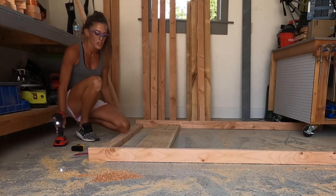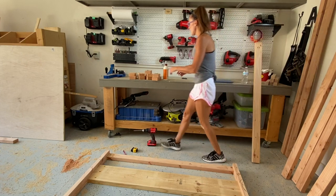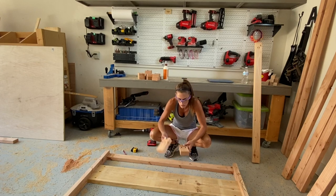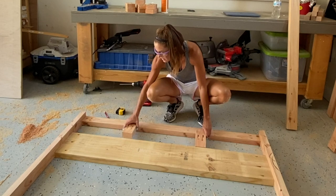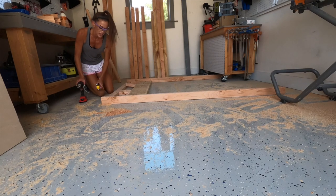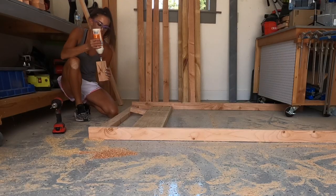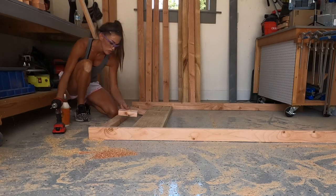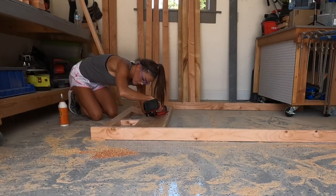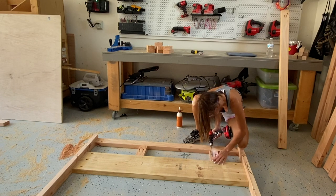I've got the two by ten on. Now I'm going to add those two little cross support pieces — they're just for decoration, and these have one and a half inch pocket holes drilled in them. I'm going to need wood filler for these. They go seven and thirteen sixteenths inches from the inside of the leg — you don't have to remember that because we've got free printable plans linked in the description box below. I'm using wood glue and two and a half inch pocket hole screws to attach. You don't really need wood glue for these, but with my daughter being nine, I don't want her to kick or knock anything loose, so wood glue will help with that.